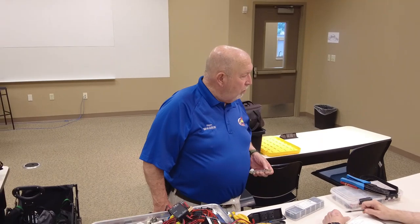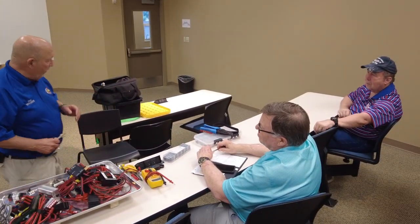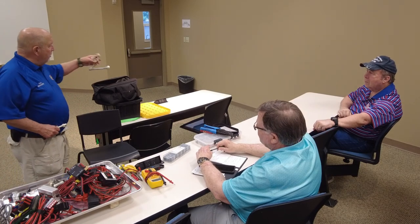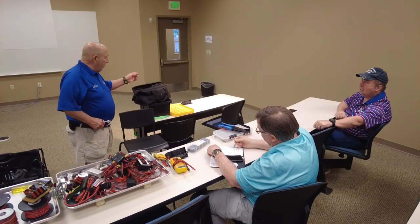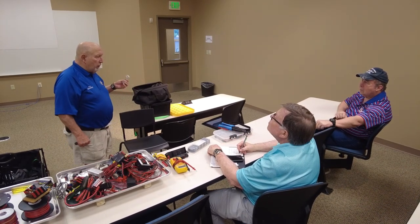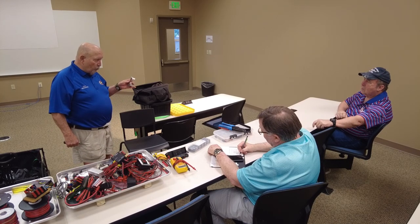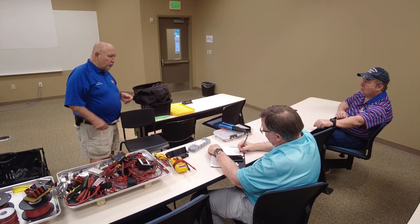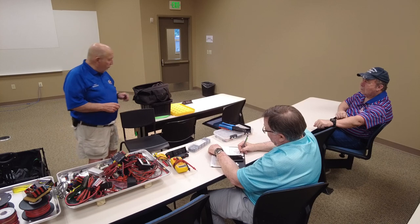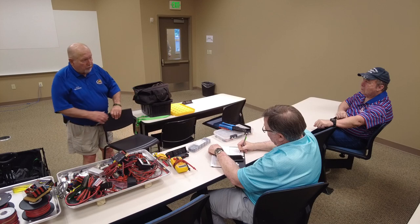Yes. How do you hook up the other end of it? Do you use number 10 wire or something? Well, you don't have to use number 10. I think this is number 10 here. That's just something I had. I've got some stranded number 10 at the house. It's orange, so that I know that that's ground wire. Actually, green would be better, because that's what the electrical standard is for a household. The green is ground, and it's not neutral. It's ground.